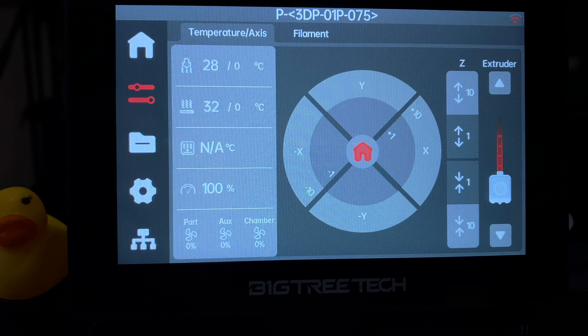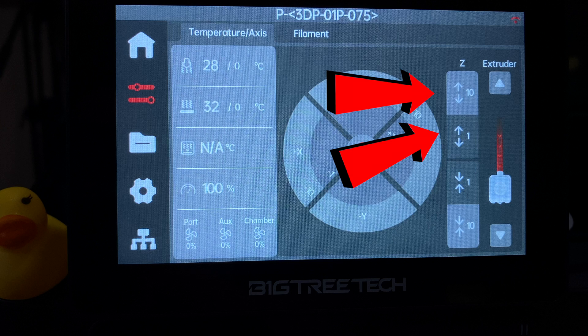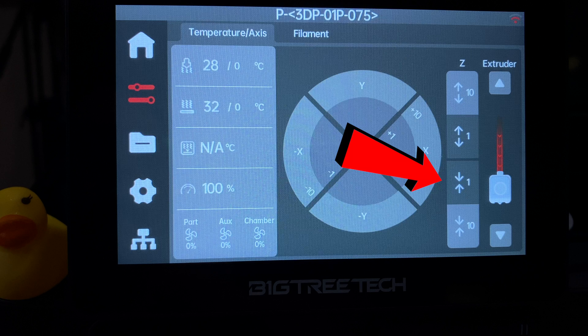There are a few things to be aware of, though. When moving the bed up or down using the Panda Touch, the buttons move the bed in the opposite direction compared to the touchscreen buttons on the X1 Series. So did Big Tree Tech blow it — is down up and up down? Actually, no. If you look closely at the icons on the bed movement buttons, the buttons on top have arrows indicating moving away from — increasing the distance between the nozzle and the bed — so the buttons on top move the bed down. The buttons on the bottom have arrows indicating moving closer to, so the ones on the bottom move the bed up toward the nozzle. The Panda Touch buttons do what they say they'll do; it's just that on the X1 Series, the buttons on top move the bed up and the buttons on the bottom move the bed down.